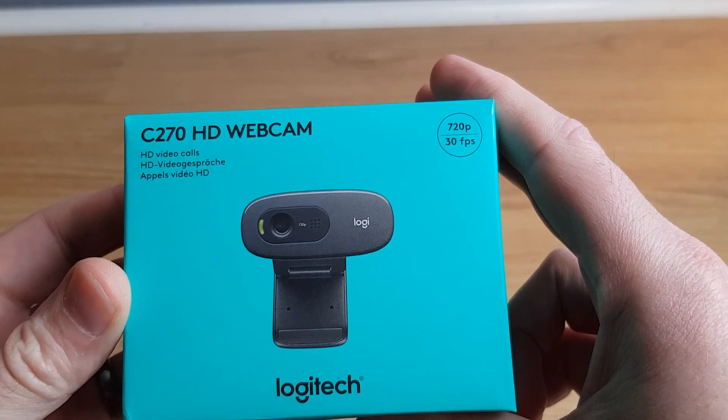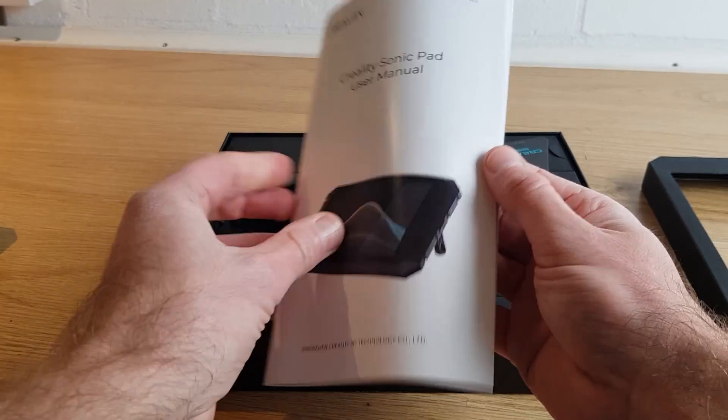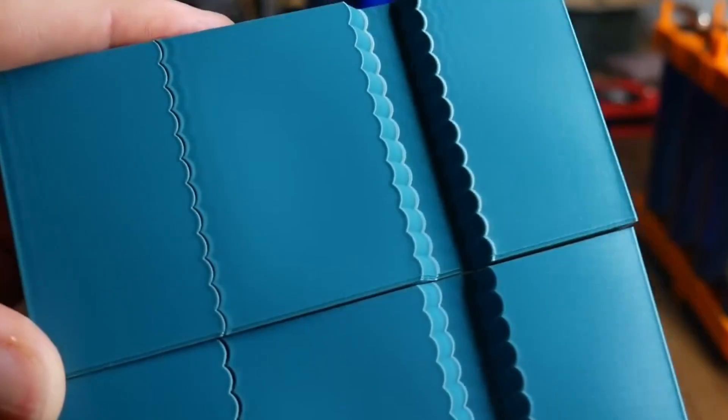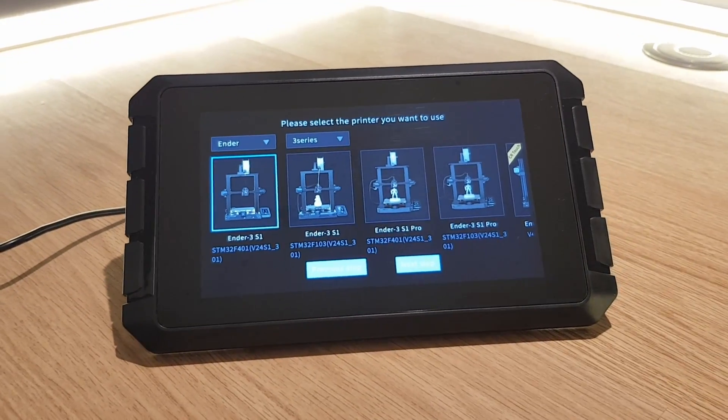There are lots of other features that the Sonic Pad has, but mostly these are Klipper features. What I can tell you is what the Sonic Pad does well and not so well. It does pretty much all that Creality say it can. In my opinion it's not plug-and-play, but it is the simplest solution I've seen to having a 3D printer up and running with Klipper. Apart from a camera that can be bought for around $20, everything you need comes in the box, including leads to connect to your 3D printer and a sensor for calibrating input shaping. Input shaping is a feature that removes ghosting from the surface of prints and allows you to push speeds even higher. The Sonic Pad has Wi-Fi connectivity, a nice responsive touchscreen, and looks a lot neater than pretty much all the other options I've seen.